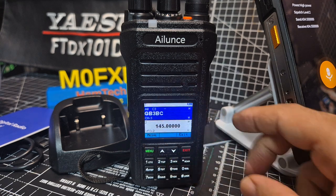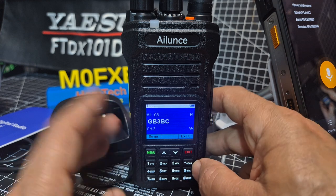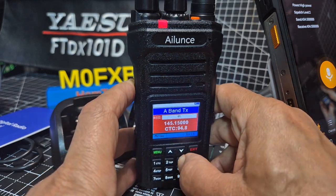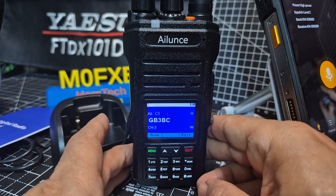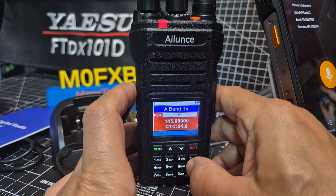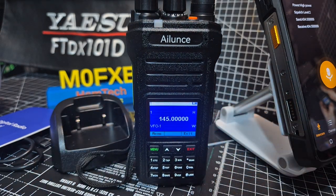To go into sort of single screen, press the hash button. And now with the new firmware, DTMF just works — it just works, as long as you've loaded the new firmware on. As you can see, just hold your PTT and dial.